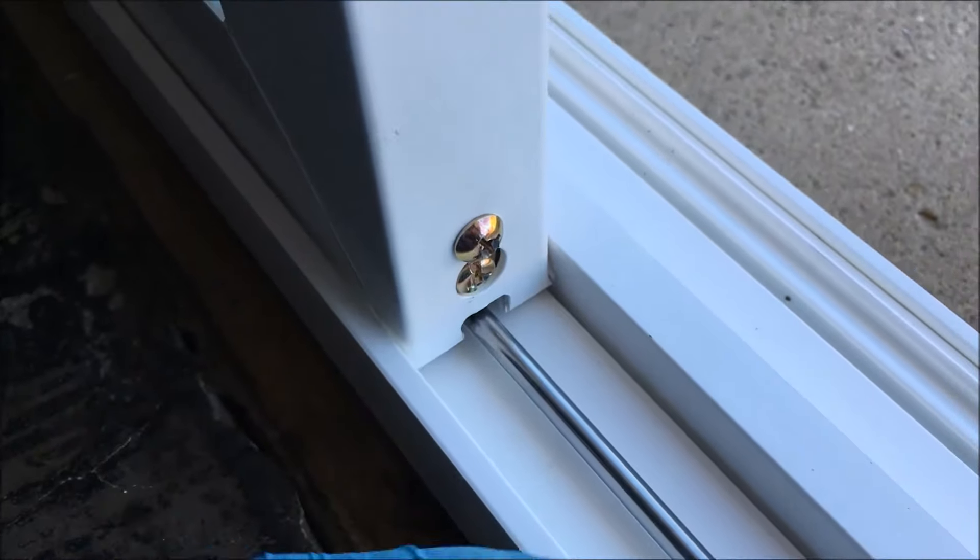Because I don't want silicone going everywhere even with the nozzle, I shake the can well, spray it a couple of times into a small container, then use a Q-tip to run along the track cap. Once a year, remove the slider, clean the roller assemblies, and give them a shot of silicone spray lubricant — any brand works.